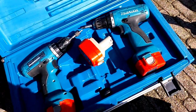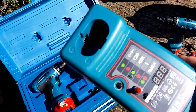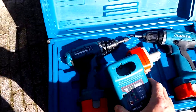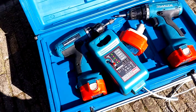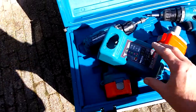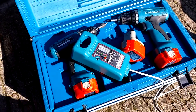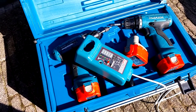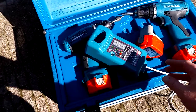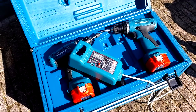The standard battery charger doesn't work on lithium-ion batteries. So what I did was rip the charger completely apart, took everything out except the contact points inside to connect with the batteries, and I put my RE-EMF charger inside. But the problem with the RE-EMF charger as I had it before was that it keeps on charging — you need an overvoltage to start charging because it oscillates. For charging batteries it is perfect, but it overcharges the batteries if you don't watch out, so you have to constantly monitor the batteries and see if they are full, because when you get over 16.8 volts you start overcharging them.